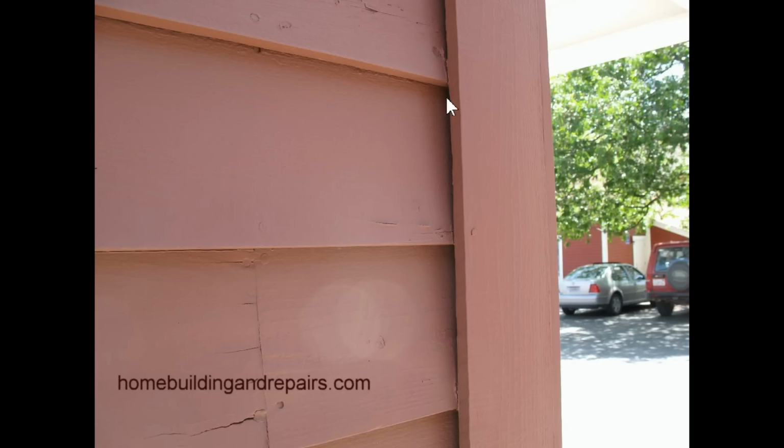So you could always put some type of filler behind this, some scraps of newspaper, so that you're not using a lot of caulking. Foam, they have a foam that you can actually buy in a roll that's used for a filler. Instead of filling this whole area with caulking, you could use some type of filler so you're not using as much caulking. Shove the filler into the larger parts that are going to take more caulking and then caulk it. Just seems like that'd be a good way to save some money.